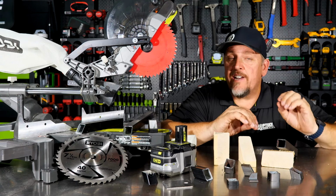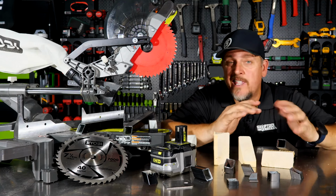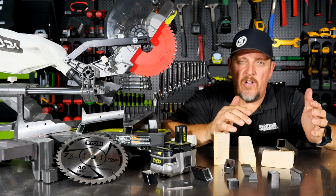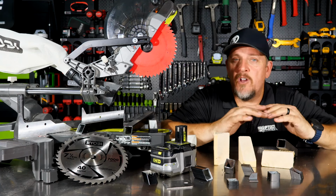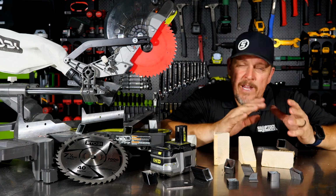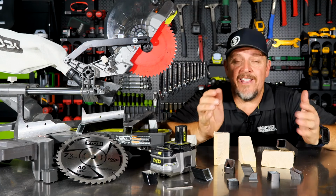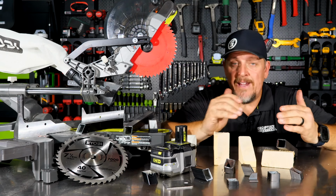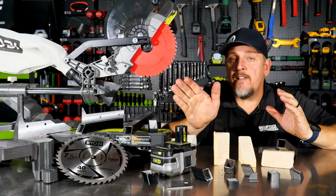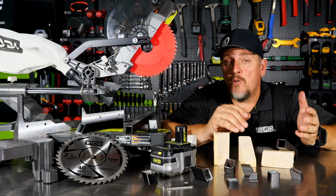It's going to be great for cutting those small pieces, 1 inch tubing, 1x2, 2x2, 1/8 inch wall, things like that. Anything thicker than that, that's when you want to step into a true metal saw. Your Evolutions, some of your Milwaukees, Makitas, DeWalts, things like that. Even abrasive saws will be fine. We typically like to stick with a cold cut saw just because it's not 500 degrees when you get done cutting. It's nice and cool to the touch, unless you've made a lot of cuts near that. Then it can tend to heat up a little bit, but still, it makes a really nice cut really quick, as well as at a rather cool temperature.